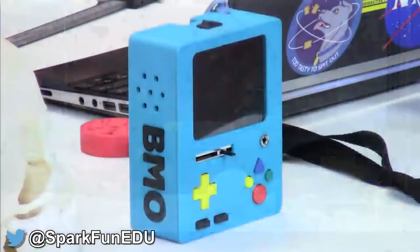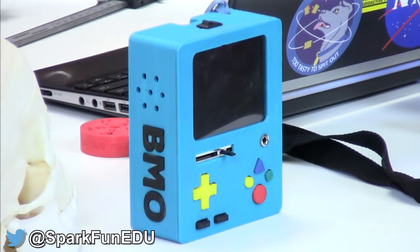Some other things that are worth pointing out. Getting your settings dialed in as precisely as you can will make the best possible quality print. Now, with the profiles that are available, you can get some generic settings, which will work, especially if you're just doing one-off prototyping or demonstrations. These generic settings will be fine, but as Lulzbot makes a lot of their own parts, it's in their best interests to reduce the need for secondary handling. So they like to get their settings and their G-code dialed in to as close to their exact spool of filament and their exact part, because making a part with a rough edge might not necessarily work if you're going to try and sell it. If it's just a demonstration, it's probably okay, but there are ways to mitigate that as well.